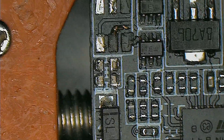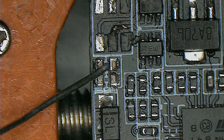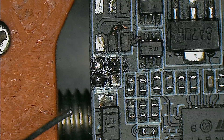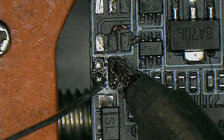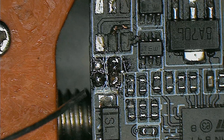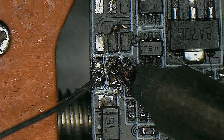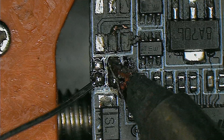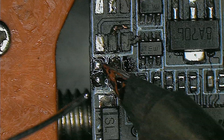What we need to do is just clean the pads a bit — taking some fresh solder and using it to clean these pads. As you can see the ones on the left melt quite easily, but the ones on the right are a bit harder to melt, and that's because they are ground. So I will need to increase the temperature of the iron just to have enough force to melt it. Even at 380 degrees Celsius it's pretty hard to melt compared to these two.